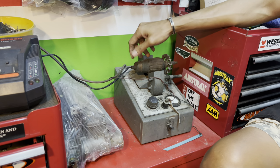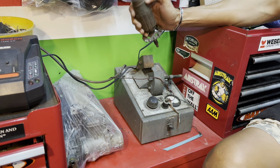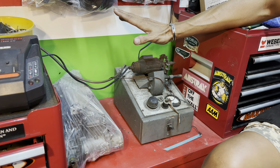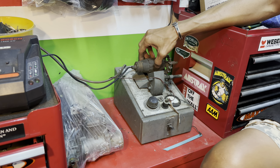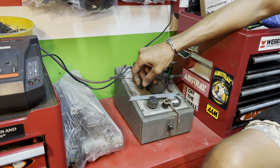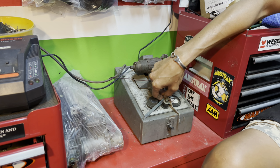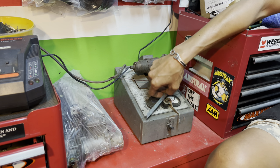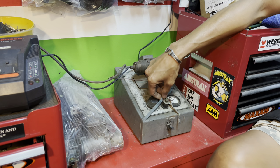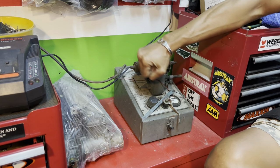When you rewind by hand, you can feel the tension. As I mentioned, different magnetos have different armature sizes, different armature sizes mean different copper wire sizes, which means different tension requirements. If you've repeatedly rewound armatures for dynamos of various sizes, you can do it for 40 to 50 years and carry that skill with you. Some machines have non-adjustable tension — it depends on the size of the lathe machine you're using. A smaller lathe won't have strong tension; a bigger lathe will have stronger tension. So it's different from using your hands, where you can feel and adjust the tension accordingly.